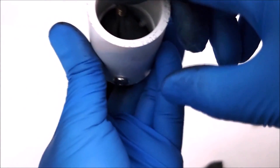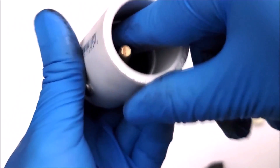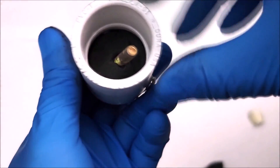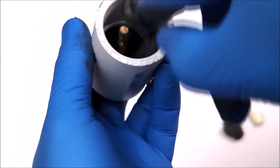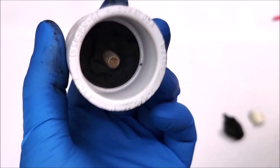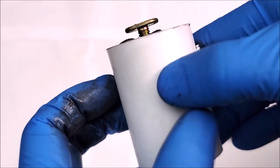Go to the other side, straighten out that bolt, and use your finger to pack it right in there. The challenge you'll face is keeping that bolt kind of straight, but the epoxy is soft and you can bend it any way you like. You can see the halfway mark — just don't go past that mark. Make sure the bolt is roughly centered; you're not going for perfection, just close enough and you're good to go.